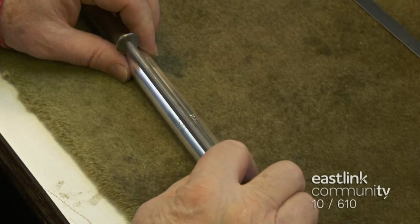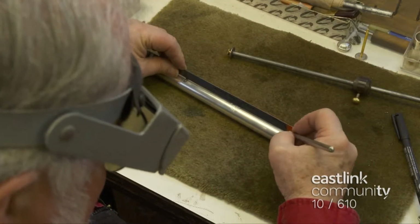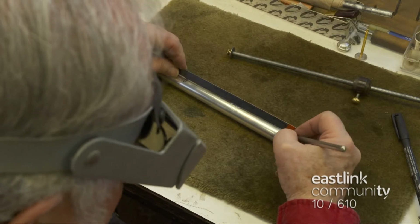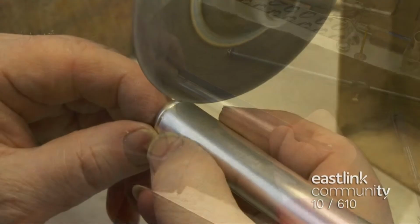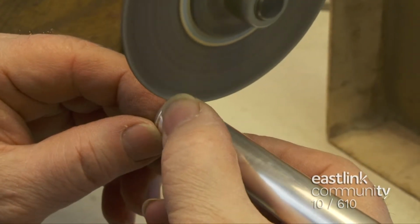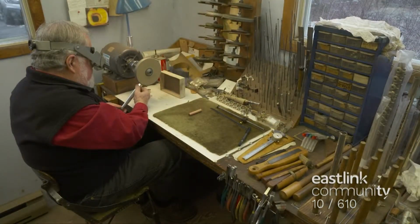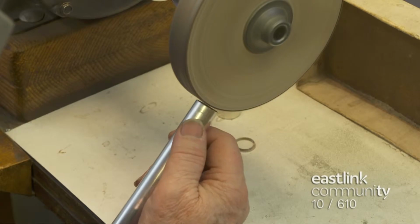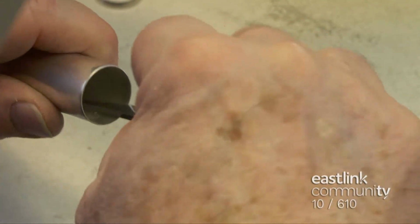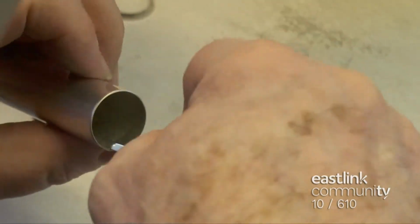Making a scribe on the exact measurement for the embouchure hole and using a caliper, making a scribe where both ends of the tube will be cut. The measurements are double-checked. Using a cutting wheel, he holds the tube and makes a cut at each end. Then, using different wheels, the flute maker works until the cut is flat, even, and smooth. The polishing wheel and a burnishing tool remove any possible rough edges.